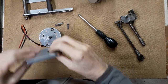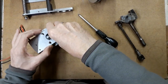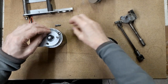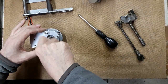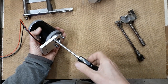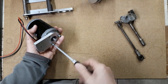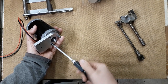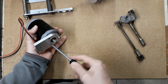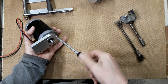The motor mounting plate is ready for installation. One of the points I want to get across in making this is that you don't need a milling machine to produce reasonably accurate work. As you've seen here, I laid this out by hand with centre popping and careful drilling, and I was able to achieve a good result. It was not necessary to open up the holes — it fits. It's a positive location and I think it's a satisfactory result.